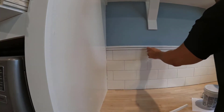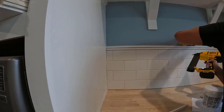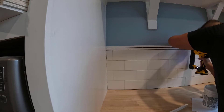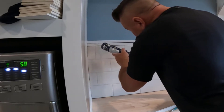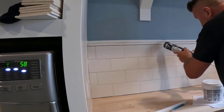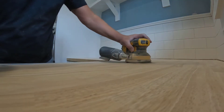The grout is much easier when you keep things clean. I had to put a little piece of trim up here — I originally had an eighth-inch spacer between the tiles, but the tiles actually have their own built-in spacer, about a sixteenth of an inch, which left a gap between the trim board I'd already pre-installed. Not a big deal — I just added a piece of trim and I'm going to caulk between the two pieces, then use grout caulk between the tile and the woodwork so there's no cracking.